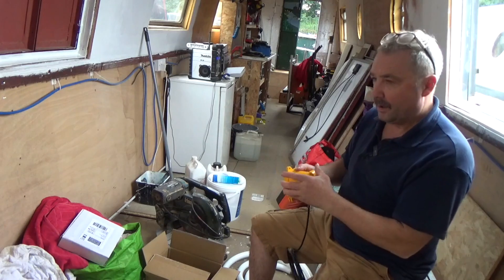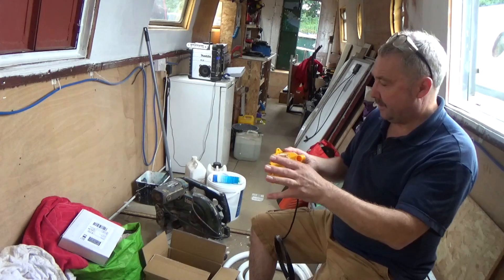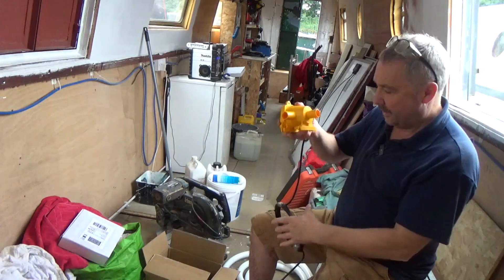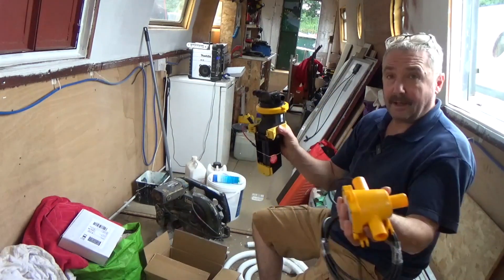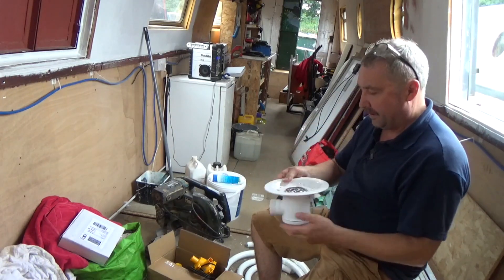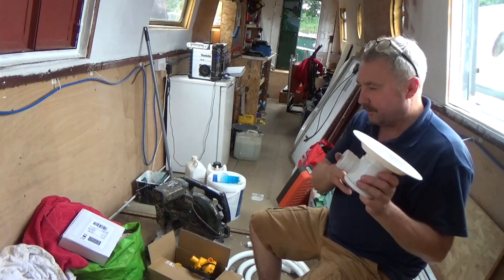Thing is, does something go wrong? Because anything that's mechanical or electrical is going to go wrong one day - might not be for a lot of years, but it will go wrong. With the sink, you can just have an outlet through the skin fitting and out - so you don't need a pump, just gravity flow out. What I'll do is put the shower onto this pump, blank one inlet off, and then the outlet from that I'll put into the same outlet as the sink going out of the bathroom. I looked at it and actually bought another gully outlet, but it doesn't work as well as this one.